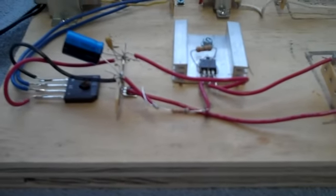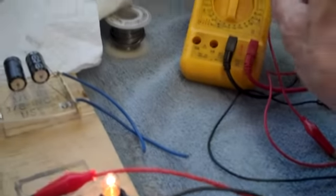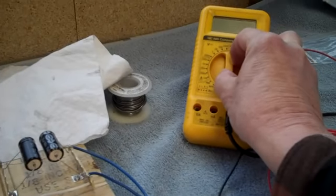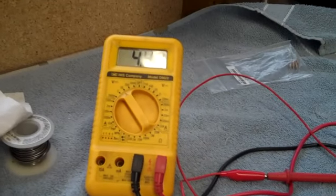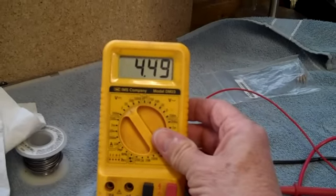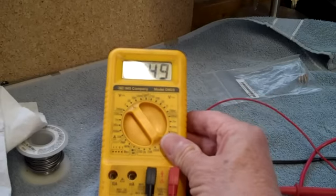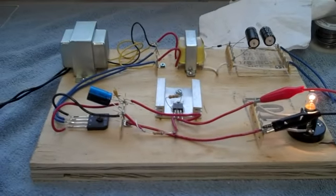The resistor is now soldered in — 620 ohms. Let's do one more check. I've got it plugged in and the multimeter is still attached. We're looking for four and a half again, remember. 4.49. Look at that. 4.50. 4.49. Wow. I think we're ready to rock and roll.